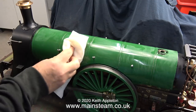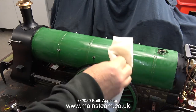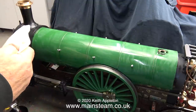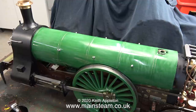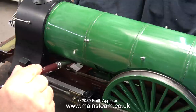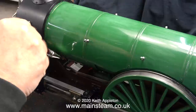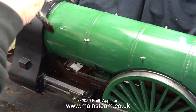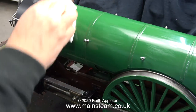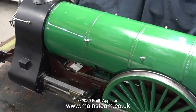A warning: do not use panel wipe on brand new enamel paint. I'm using it on this Ronseal hard glazed varnish which has been on there for about a month. As you can see it looks pretty dreadful - all scratched and horrible - but I'm really hoping it's going to look better once I've re-varnished it. This varnish is thinned 50-50 with white spirit. If I apply it too thickly it's going to run down the sides. In this clip I'm using a wipe-on wipe-off method because I put too much varnish on with the brush.